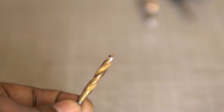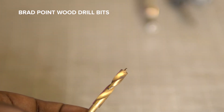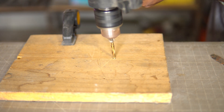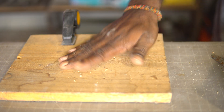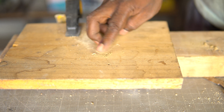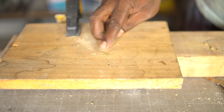These drill bits are used for wood. The size may vary based on the hole you need to drill, but note that they all have a pointed brad. The purpose of this is precision. If a hole is drilled in the wrong place or slightly offset, unlike other materials, it will be very difficult to close it up without being visible or without losing the same strength as before.